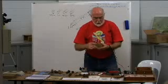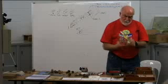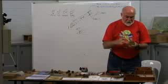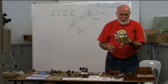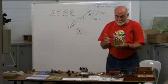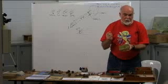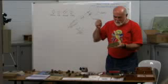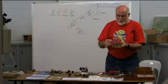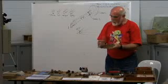But a lot of the engraving that my dad did and my uncle did and my grandfather did was just on a block of wood. And this is a plate of brass which has just been stuck on there with a bit of shellac. This is one that I'm working on at present, and this is a very interesting example because it's going to be a combination of machine engraving, like you see the Mr. Minute people with their little machine engravers, and hand engraving. So I'm going to rough that out with the machine first and then finish it off by hand.